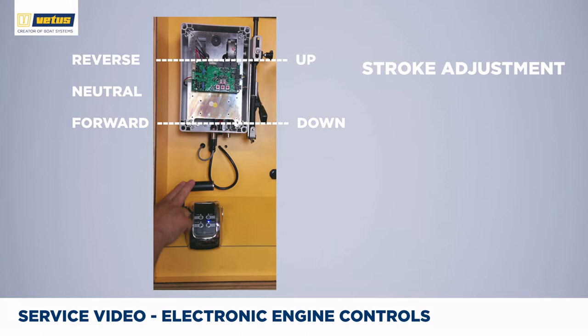To change the direction of travel, press the up and down button at the same time. Press enter, and depending on the system you have to change the A1, 2, 3, or 4 setting — the manual will tell you which one to change. To change, simply push up or down. Press enter to confirm, and now check correct operation. You can see that now if I push the control lever in the reverse position on the dashboard, the lever moves in the up direction, which is indeed reverse on the gearbox. We have confirmed that we have changed the direction of travel.